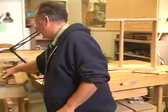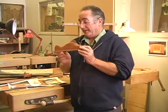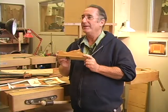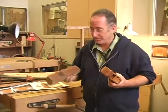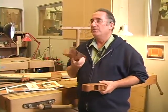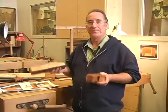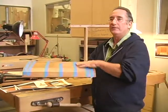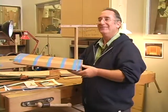For the concave side, I use a round bottom plane. This plane has a very slight round, which works in the flatter section. This plane has a more aggressive round that fits over in this area. And then this is a molding plane with quite the round for finishing up this tight joint right in here. These I made — this was the first plane I ever made, before I was a student at the College of the Redwoods. When I was there, if I ever wanted to make my bench mates laugh, I'd pull this out because they thought it was the silliest thing they'd ever seen. But I still use it and it works well. When I teach my classes here, the first project on the first day is to learn how to make a hand plane. For the convex side of the panel, you can just use a standard flat plane — you don't need to make a convex plane.